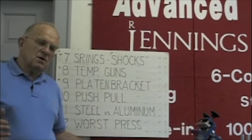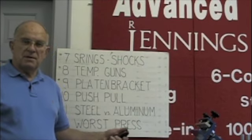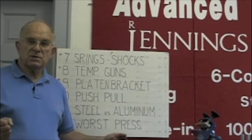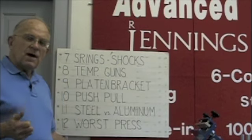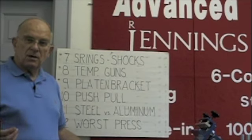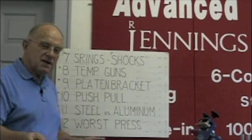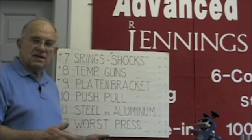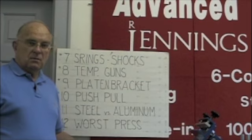And many years ago, most of the presses were sheet metal and they looked mammoth, but they were very flexible, and the industry's pretty much gotten away from that. Then it went to structural steel, which was better. But the problem with steel is that it weighs, size for size, 2.8 times what aluminum weighs. So this is a labor business. You're rotating screens, you're rotating platens. You have to push, and it takes the same effort to stop the rotation as it takes to start the rotation. And that's work, and if you're doing this all day long, whoa.